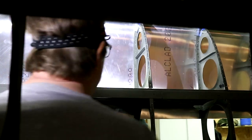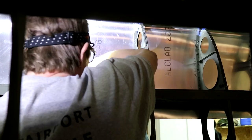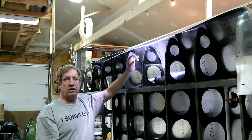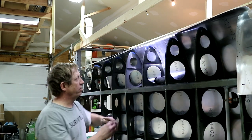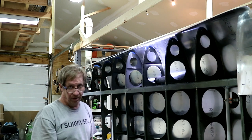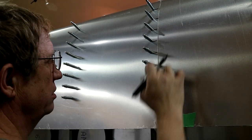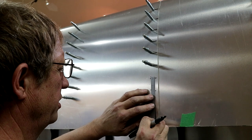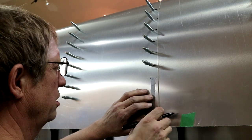After back-drilling the bottom, I re-cleoed the top sheets down and uncleoed the bottom part so I can get in here and back-drill this seam all the way down — having someone push a piece of wood on the other side. Now I'm laying out the double row of rivets for the overlap. The first row is already in there, so I'm going to use this scale that's half an inch wide, center it on these holes, and mark at three-quarters. That'll be my bottom hole.